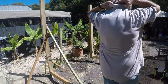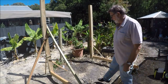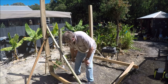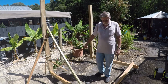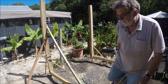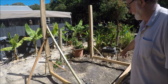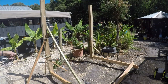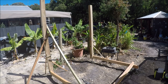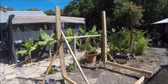It's day two. We're keeping the rails in position - we've notched them out and coach-screwed them in. Then we'll have our joists going across and that should give us the floor. Of course it'll have to be braced at the top and sides, but we'll get to that. These two are in and I'm just in the process of bracing them before starting on the others.